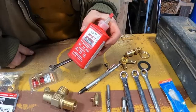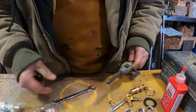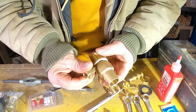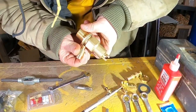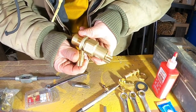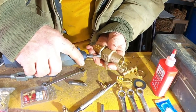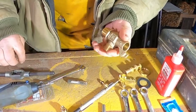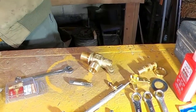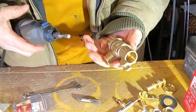I use cutting fluid to help the tapping process — it's not absolutely necessary, but it helps. We're going to drill a hole in there, and being that there's all this stuff in here, we've got to open that up so we can get our drill bit down through there easier. I'll use a Dremel to cut this shoulder back — you can use a file, you don't necessarily have to use a Dremel, I just happen to have one.